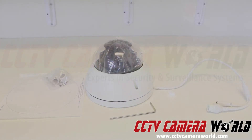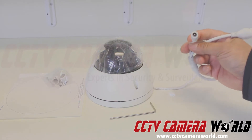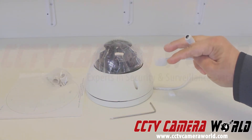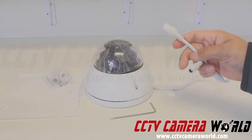Here we're going to show you what comes with our dome cameras that have an audio line-in connector inside the camera. This camera has a pigtail that only has an RJ45 pigtail, which is for PoE. It is a PoE IP camera, and then there's a 12-volt DC. You can choose to run it over a PoE switch, not needing a 12-volt DC connector — so this just becomes vestigial. You don't need to use it at all; you can tape it up if you're mounting the camera outside.